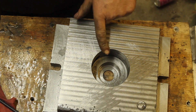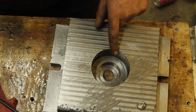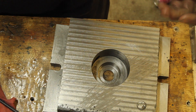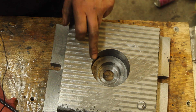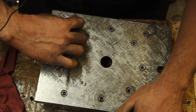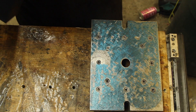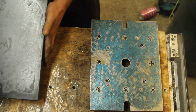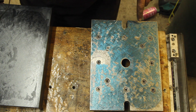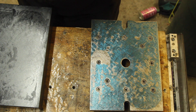I've got this thing bored out to about 3.2 inches, so it's got about another two hundred thousandths to come off the diameter. I want to check and see if it's distorted any from scraping it before, and then finish scraping it. These all seem pretty tight still — that's a good sign. That's obviously a really heavy print but it really hasn't changed very much. It's still high here, here, and there. So I'm going to go ahead and finish scraping this.